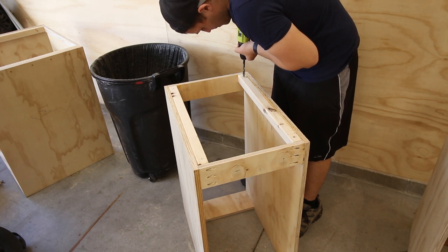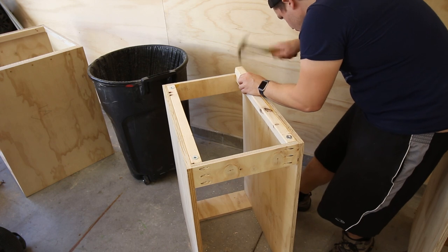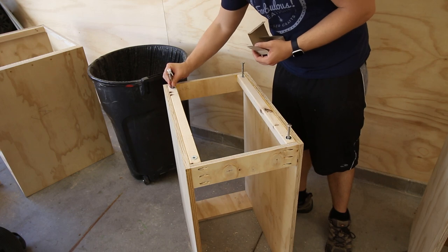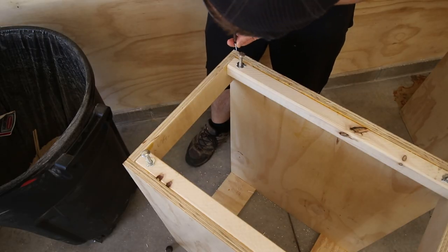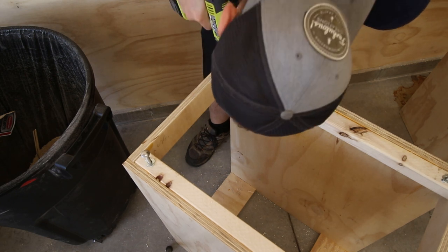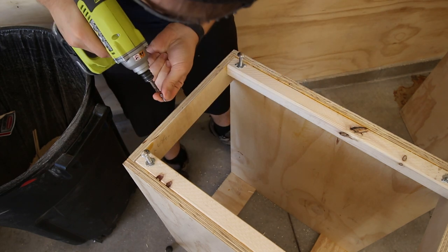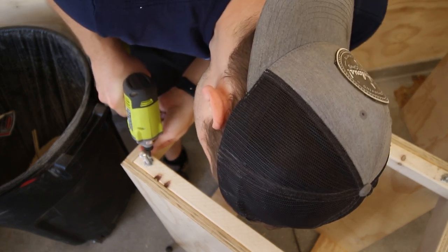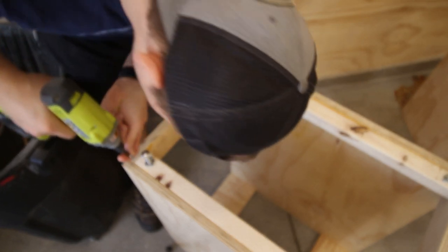After the glue had dried, I could drill a hole in each corner of the base cabinet for the T-nuts to go into. After pounding the T-nuts down and starting to screw the carriage bolt feet in, I found that the T-nuts weren't super grippy into their holes and that they kind of wanted to slip out. To remedy this, I used some spare drawer slide screws to hold the T-nuts in place in the various corners of its profile. This looked a little janky, but seemed to solve the problem at hand. Let me know if you know of a better way to make sure T-nuts stay in place — I'm sure epoxy would work, but also seemed like overkill.